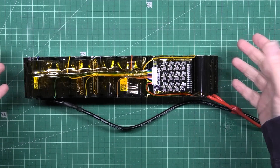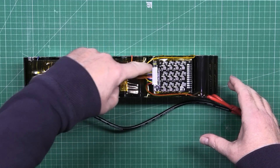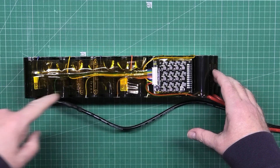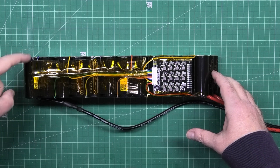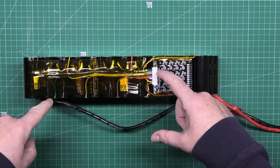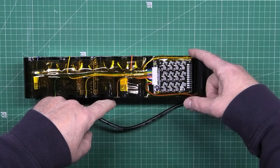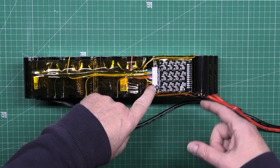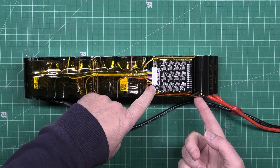To recap how I've wired it: you get the first wire labelled B minus and that goes to battery minus. You get the next one and that goes to the first positive. Then the next one goes to the next positive — positive, positive, positive — until you get to the last one, which goes to the main battery positive, the last positive in the string.